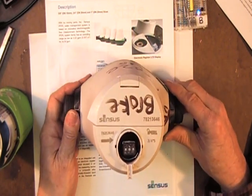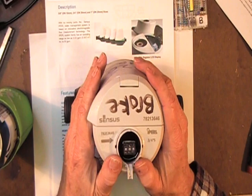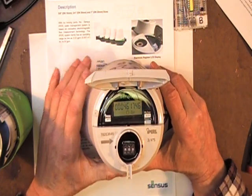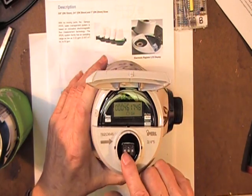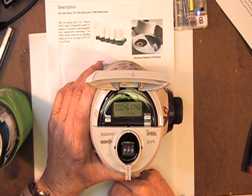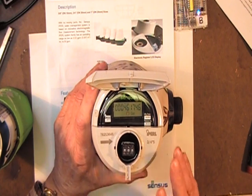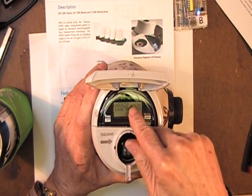Normally residential water meters are hard to get into because the seller — the water company — doesn't want customers defeating the meter. It used to be that this remote connection just fed a counter mounted outside the house, and it was easy for the customer to just disconnect the wire for 28 days and then hook it back up. The newer meters with outside transmitting devices periodically reach down electrically and read the setting from the internals of the meter.